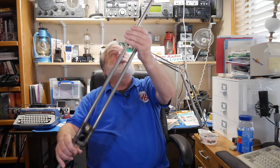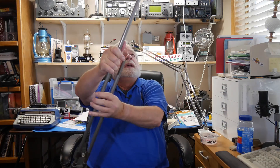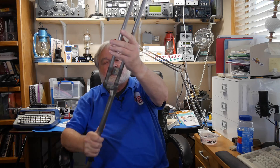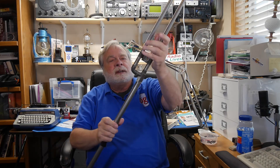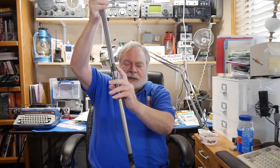Now for this one I'm going to have to back up a little bit. This is a J-Pole — a regular size J-Pole. You might say, well, normally this is an outdoor antenna. But there's nothing to say that you can't attach the coax here and then lean this in the corner — any corner. Don't want your kids touching it while you're operating it, but it would work just fine. Leave it operating in a corner, vertically positioned, because it's vertical polarization.